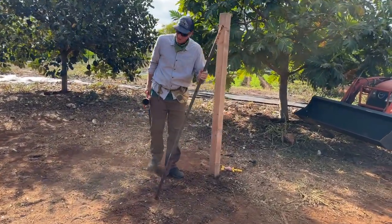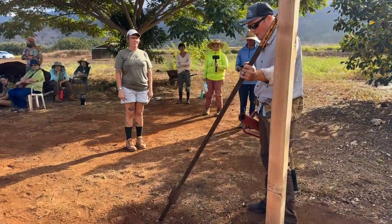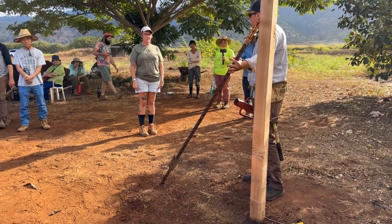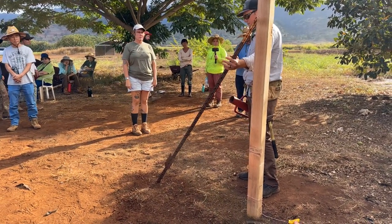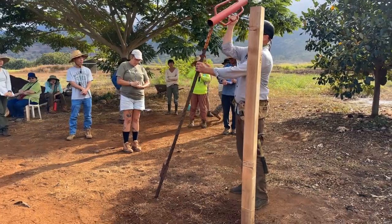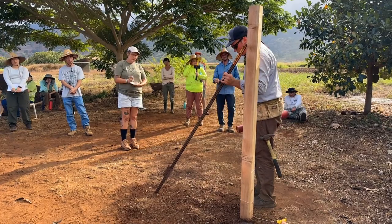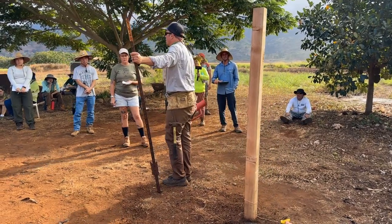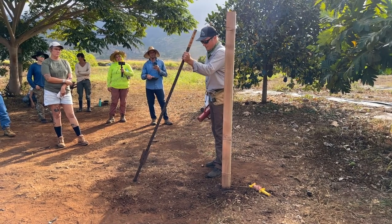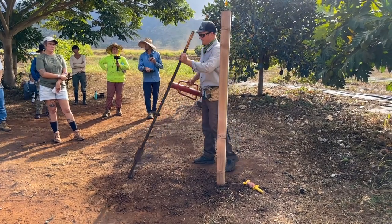What do you call this style? I would call this one like a 45 corner, because ultimately we're just making like a 45 on this here. The way I like to put these 45s in — I've found like one full step, about a yard, is about a good distance. So I'm going to put this post in and I'm not necessarily going to try to drive it in at its full angle — I'm going to bend it once it's in there.